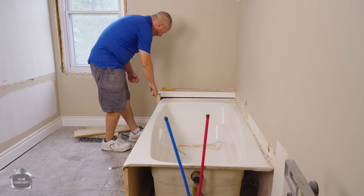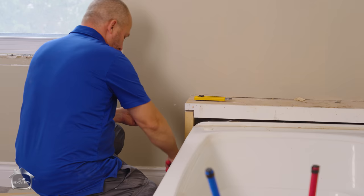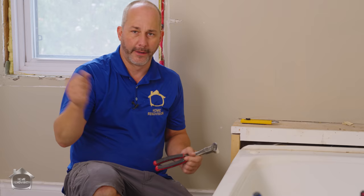This is a great tool — I think it's a Husky brand — it's a brad nail remover. When you're doing a demolition, the best time to remove nails is right away. Be really thorough — if you leave one nail, and inevitably someone comes along to do mud or caulking and hits a nail, it can damage your tool and slice your fingers open. Make sure you have your electrical tape handy.